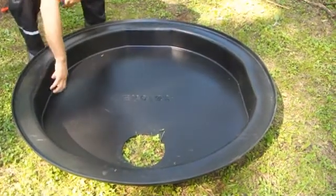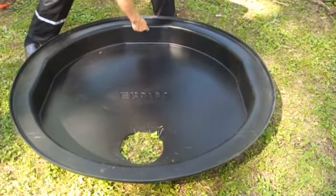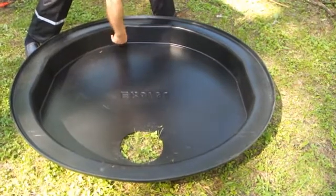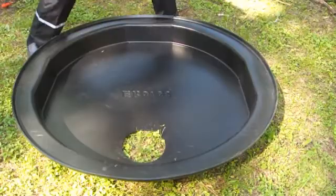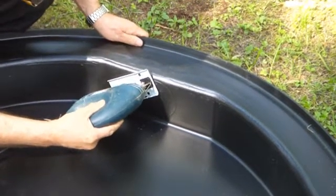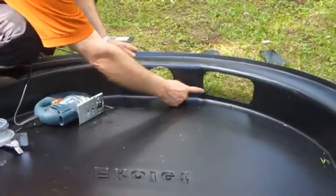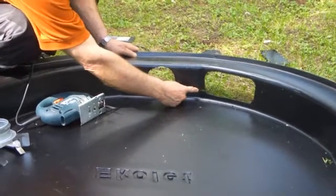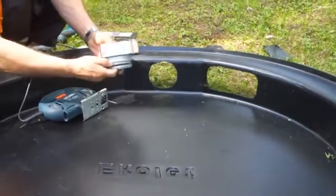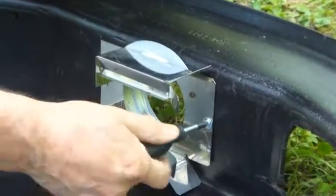From one of the three alternative directions, make an opening into the cover of the tank for the ventilation pipe and an inspection hole on either side of the opening. The spots are already marked. Make the openings. Make a groove of about 3 cm long for the wiring or the ventilation to the side of the inspection hole. Mount the ventilation casing to its place with two screws.